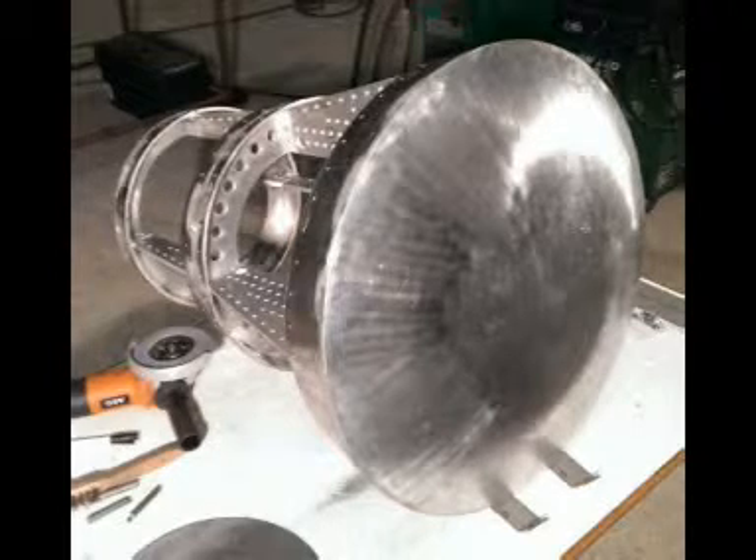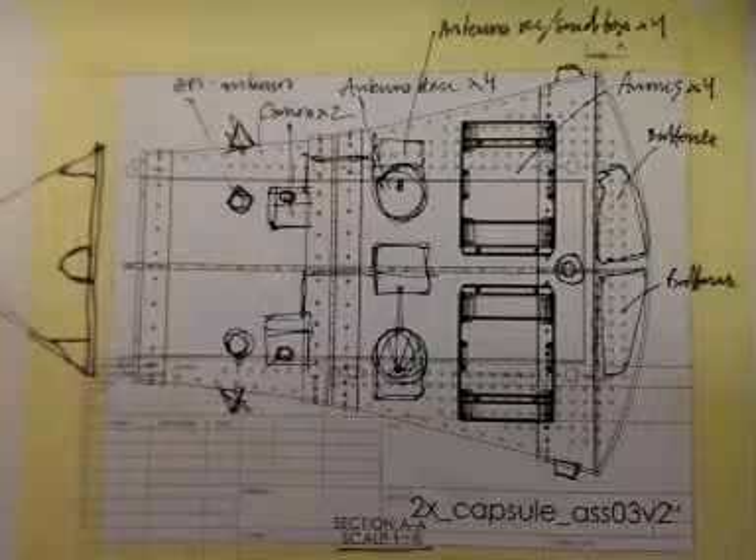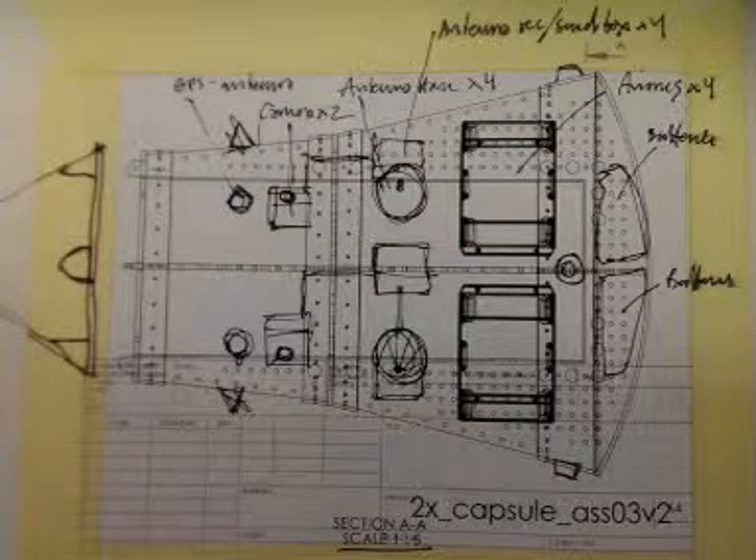The side panels are attached and fitted to the main structure and held in place, with welding joints cut in for a welding connection. There will be eight side panels covering the capsule. These panels will have to be bolted on all four sides of each panel, and this requires additional side structures running down along the main structure. The dimensions of these bars have been extracted from SolidWorks but have to be tailored individually to each side, because there are always irregularities on hand-made prototypes like this. In many locations it is not possible to use TIG welding, and in those places MIG welding was used for the final assembly.